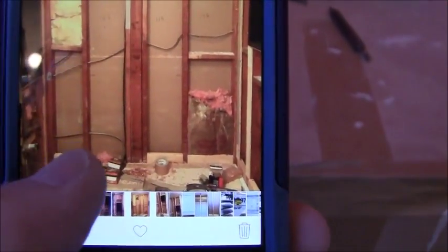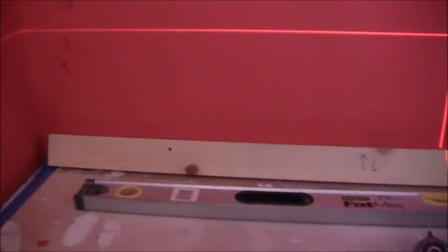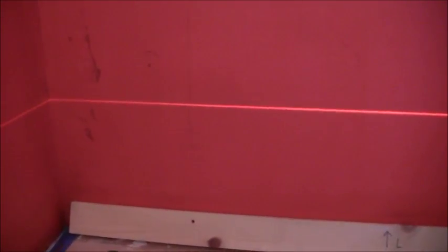Now the stud that I'm going to hook into right now is the one right there where my thumb is at. And I can see that there is an electrical line going right there, and I do not want to put a nail there because there's no nailing plate on that. You see that? There's no nailing plate on that. So on my marks on the wall, you'll see I've labeled it exactly how many inches no nail. So I know that it's 8 inches off the bottom and 32 inches. So if I took down where my stud location is, and then I measured up 8 inches, and then I go 1 inch below and 1 inch above, so it's at 7 to 9 inches, and I said no nail there. So it's pretty close to where I want it to be.